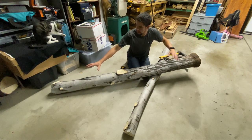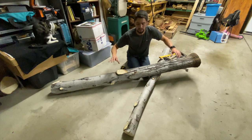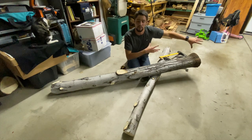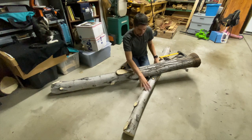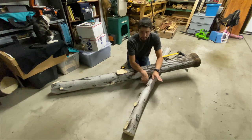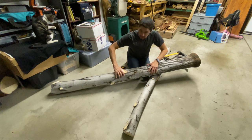This full piece here is going to be about 6 and a half feet long. You want to have a little extra on the end in case you have any cracking that happens, called checking — that's where the wood starts cracking from the moisture leaving. These two pieces were one and this one doesn't really have a lot of usable wood in it, it's got a lot of knots, so I might turn it into something else, not bows. This one I think I can get a couple of bows out of, minus this one knot.